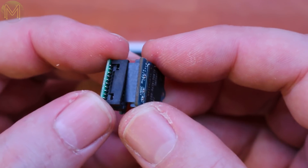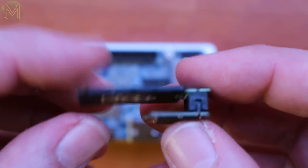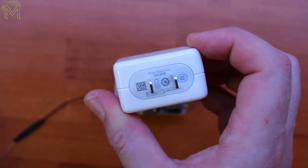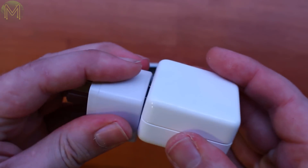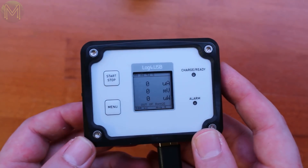I also purchased an EMMC module along with the SD card adapter to test EMMC booting. The power pack is pretty chunky — 5V at 4A is a fair amount of current through some thin cables. I would have preferred a 12V DC supply, as the lower voltage and higher current causes all sorts of issues with connectors. As in all my reviews, I log both voltage and current using a power logger.